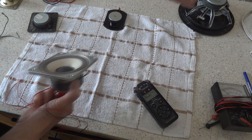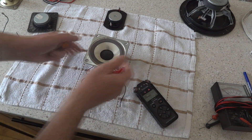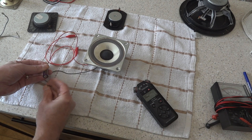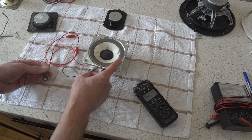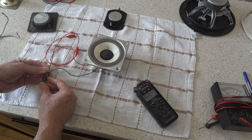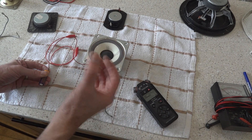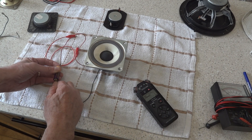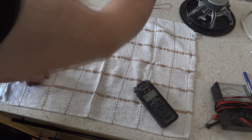We're going to go on to the mid-range now. That cone will move in and out — you can see it clearly on the bigger cone but on this smaller, tighter cone you may not see it very well. We've got a couple of wires here so we can hear the noise. I can just see that cone moving out on the outskirts of the rim. You can hear that as a higher-pitched noise — it's a mid-range driver, so it gives mid-range frequencies, pitching upward, whereas the bigger unit gives more of a bass sound.